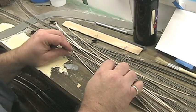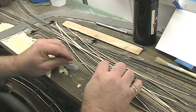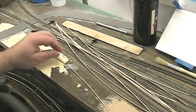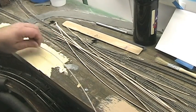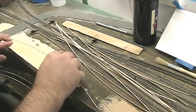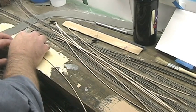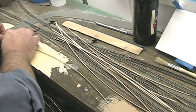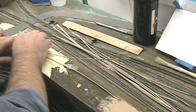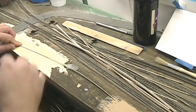Then take it to your location and tack it down, and as it dries it'll hold the bend you put in there without splitting. That's the tip that actually helped me make this bend right in here. Anyway, let me go start tacking this down. I think I'm going to need to use a little hot water right here, because I want to get this to bend fairly radically — you know, like when two roads merge and you have this bend. So that's what I'm going to go do.